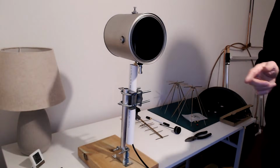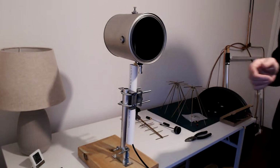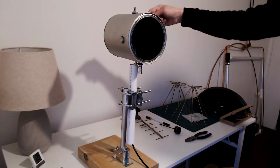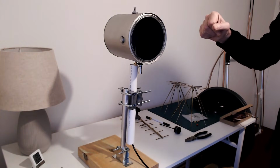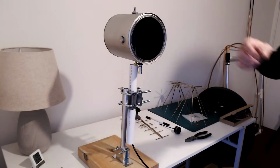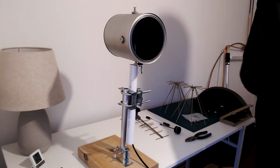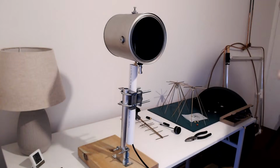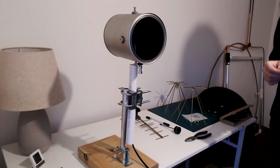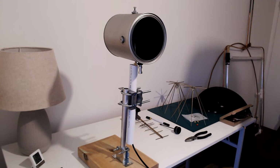It's very stable as I walk around as well. This is because it's not being affected by reflections from me going around behind the antenna and entering from behind, which causes more complex interference patterns. Because it's a really narrow beam, it's kind of ignoring me, and reflections are only going in there when I move around. So there we are, minus 35 dB. That's nice. So I think that's 8 antennas now that I've tested.